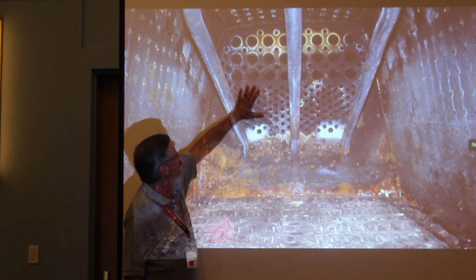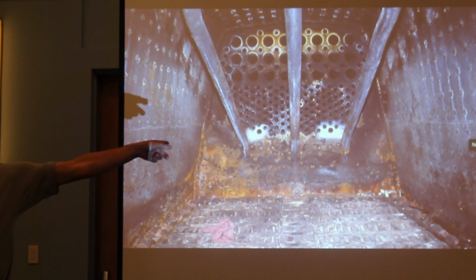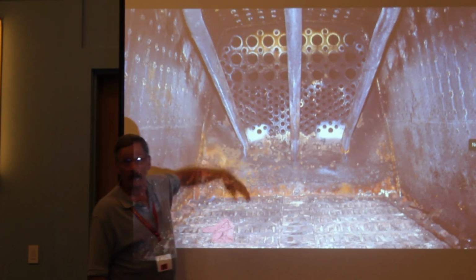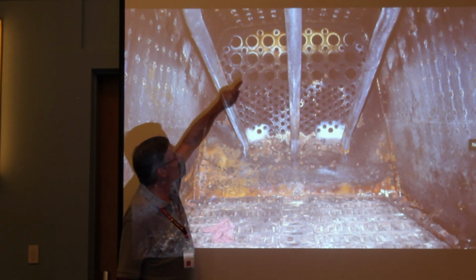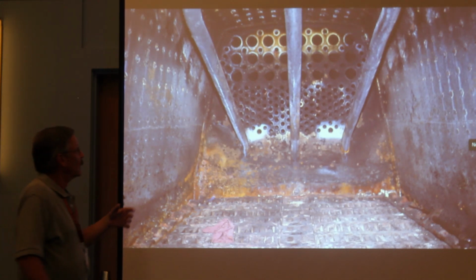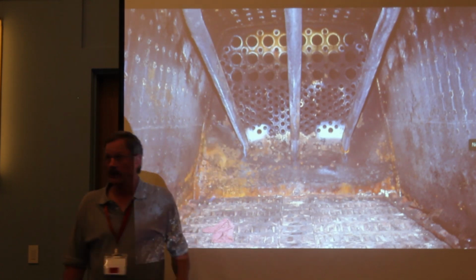These are 2-inch tubes, and these are superheater flues. You weren't allowed to safe end the superheater flues on the Type A units. They're 5.5 or 5 3/8 inches in diameter. The superheater flues are right here. You weren't allowed to safe end those, but the smaller tubes you were allowed to. You see how the layout is, that's a Type A. Time went on, they went to a Type E, and its superheater tubes were much smaller in diameter, because on the Type A, the superheater units had 4 passes in them, and the Type E, which is a more modern type, had 2 passes, so the tubes could be a lot smaller, and you could safe end those.